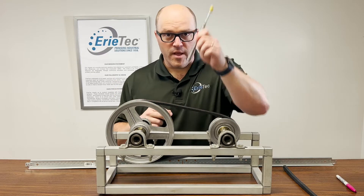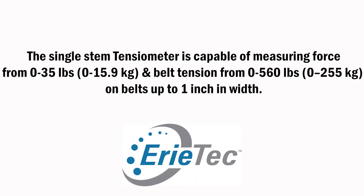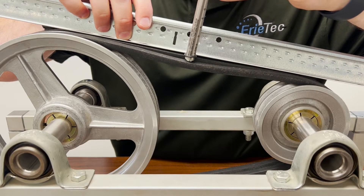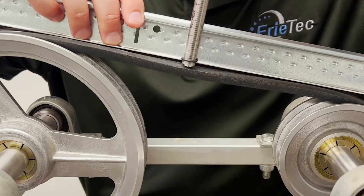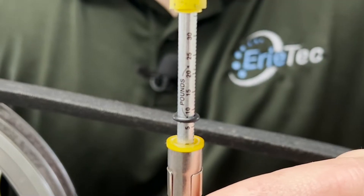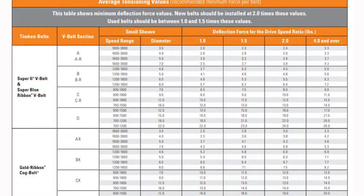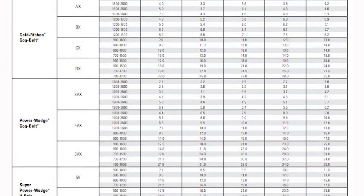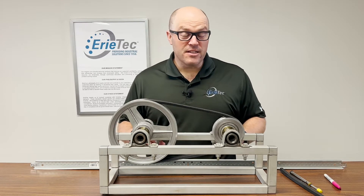For this demonstration we're at 12 inches, which translates to 3/16 of an inch, which we already have this set for. Next, we're going to set the small o-ring to zero. What we're going to measure is the force applied when we push down on the belt to make it level. That will show us on the small o-ring the amount of force needed. We then compare that information to a chart provided with the tensiometer, and that tells us whether or not the belt is tensioned properly.